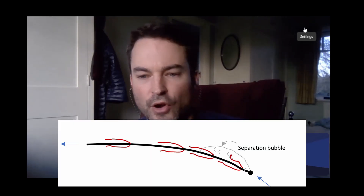They've approached this from two directions. Before, they had solid wings — clearly the best from a performance point of view — but massive logistical challenges: it took around 30 people to put a wing up. At the other end of the performance spectrum you have a conventional single skin sail hanging off a mast, and the difficulty is that you end up with quite large separation bubbles around the back edge of the mast on both the windward and leeward sides of the sail.